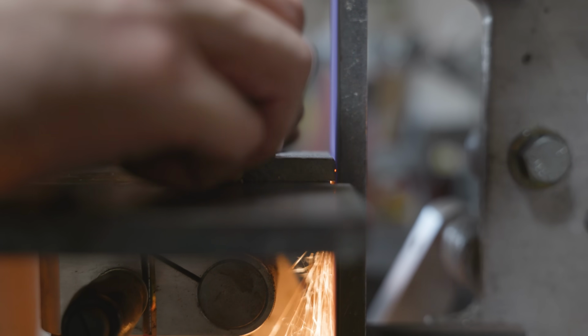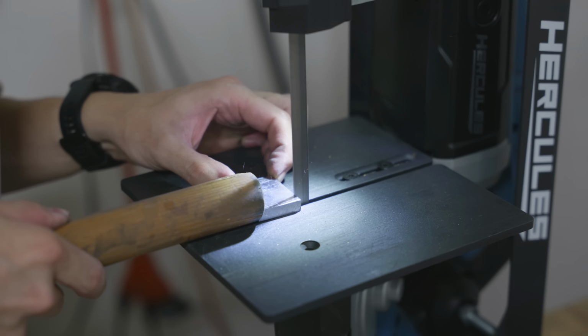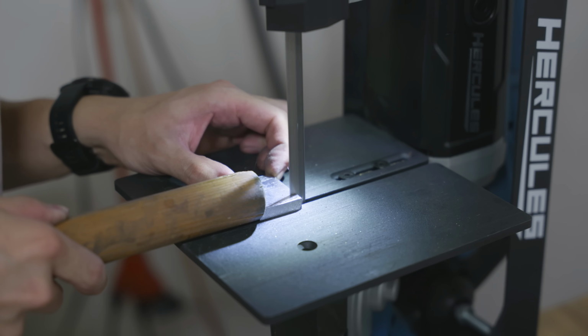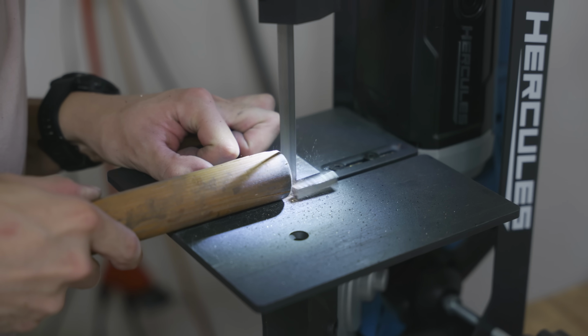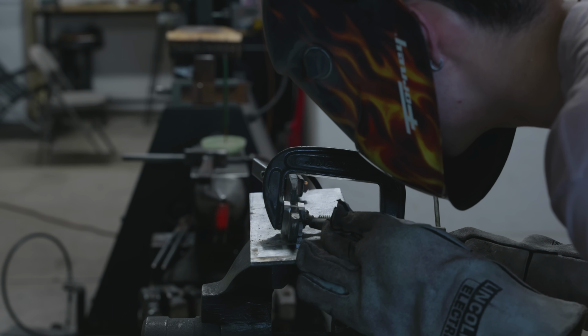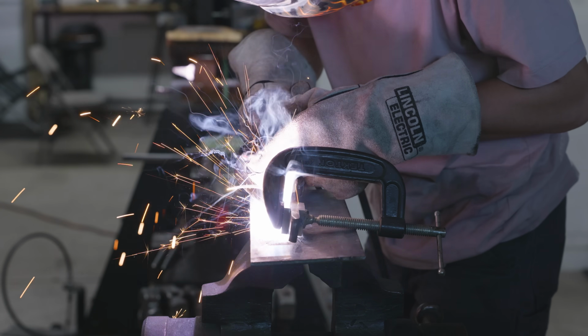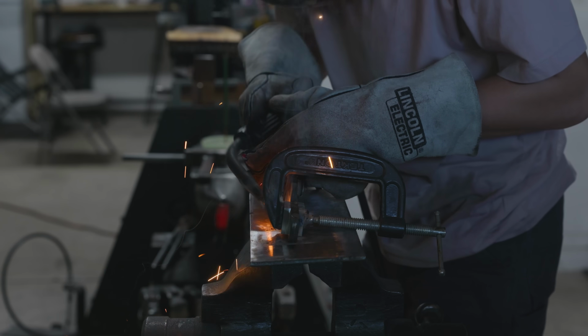These bolsters are actually made from the exact same mosaic as the blade itself. They're just a little bit thinner than the original tiles and I have to grind off those corners so that they're rectangular rather than parallelogram. As for getting these secured to the blade for the forge welding, I just do two light tacks on each bolster. I don't need to do too much at all.